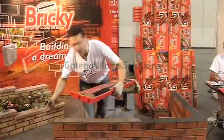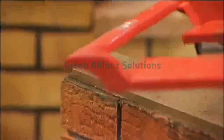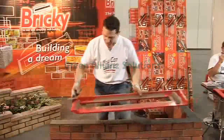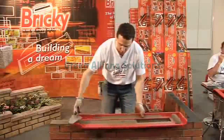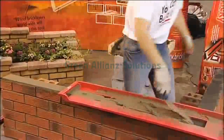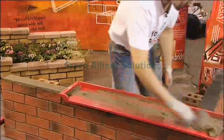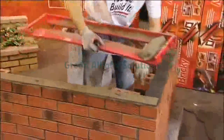The closed end gives us a perfect square bed to begin. We now swing the tool around — the back end is open and bridged. So as we reposition it on the wall, we slide the tool along, pressing the mortar dome into the cutaway section and scraping it across. We come to the corner, and the lug underneath hits our corner brick — we finish perfect.